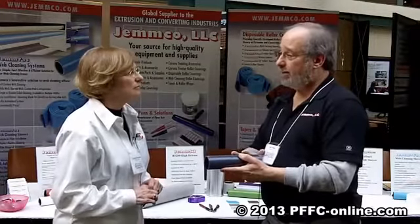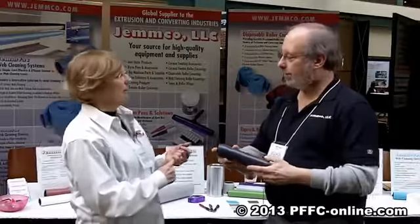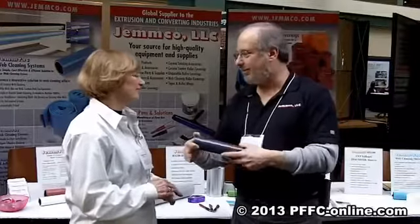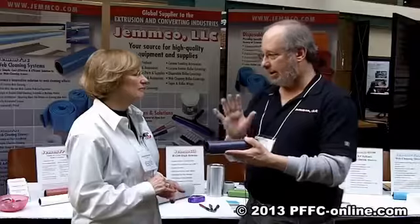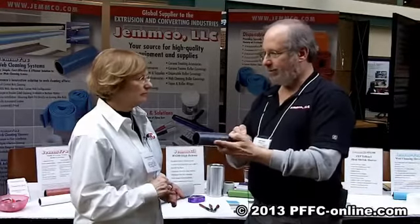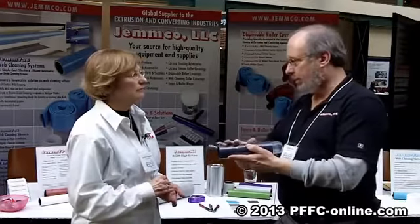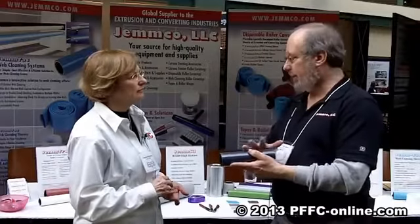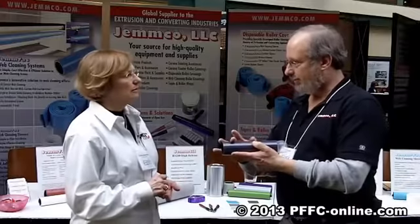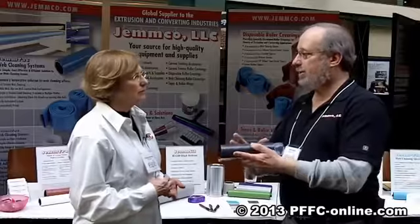We use it in some applications like extrusion nip rolls. I was going to ask, extrusion lamination maybe? Yep, extrusion nip rolls, so you don't have to wrap the Teflon tapes, which we also sell. It eliminates that. The big difficulty there is you have to get pretty good at it. We sell it for idler rolls as non-etched, so you don't have to bond or glue it. If you're going to put it in a nipping application, we also have a chemical etch on the back side of it, and we sell it with an adhesive, so you can shrink it down and it will bond to the existing rubber.